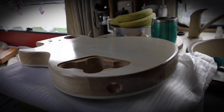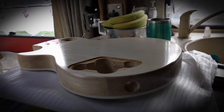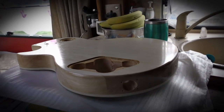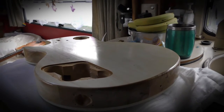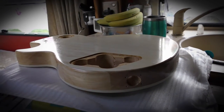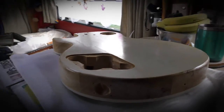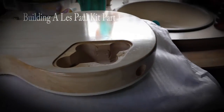Each coat of the linseed oil needs at least 24 hours to dry, really. I've just put a fine surface on here to let this one absorb into the wood and seal it. I've only done the back at the moment. I'll do one panel at a time, or I shall get one coat on each part of the panel so it can soak evenly into all the guitar. So it will take a long time, but hopefully it'll be worth it. Only time will tell, won't it?